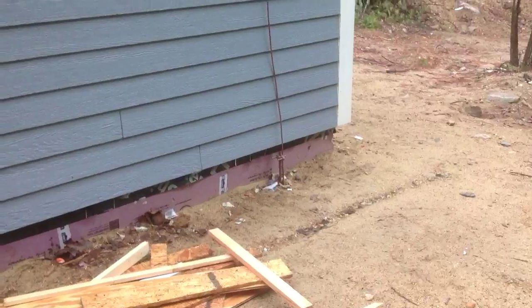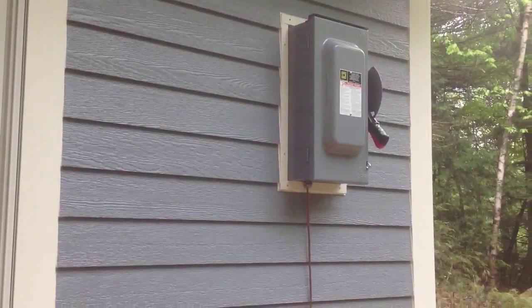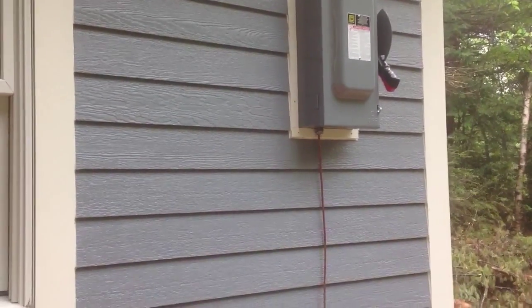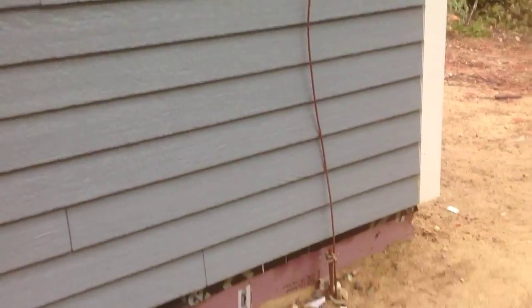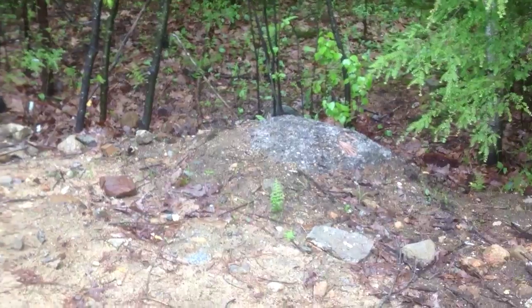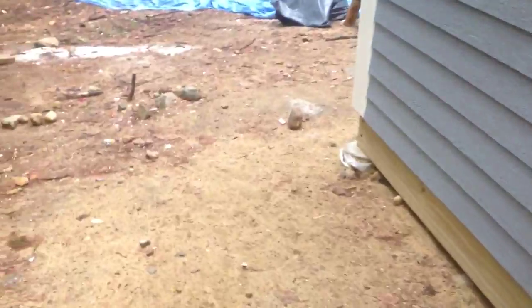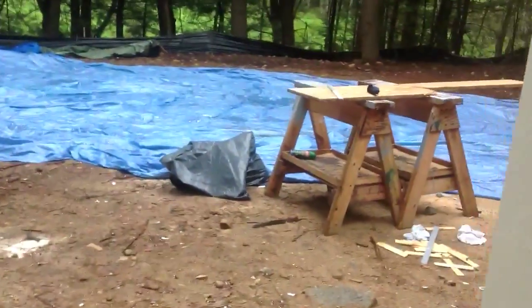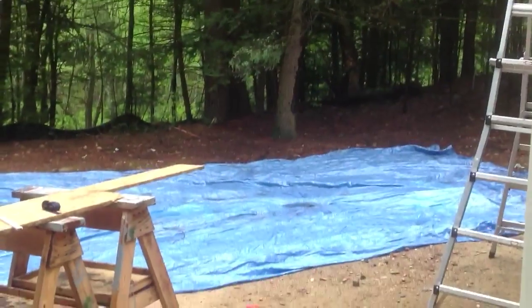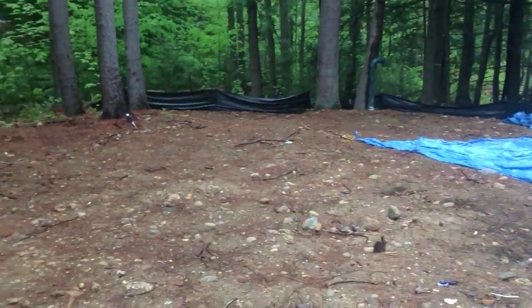You haven't seen the trim around my disconnect — that's my disconnect. There's going to be a piece of gray conduit that goes down to the ground and over to roughly where that rock is. I'm going to pour a small slab of concrete there and put that blue box — which will be painted green by the time you see it — on top of it.